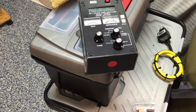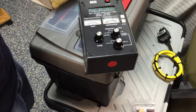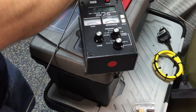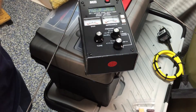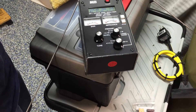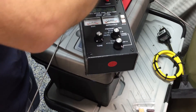This center radial is about to give up — I may end up having to replace it, which is fine. Hopefully it at least allows us to get tuned here. It's not going to allow us to get tuned — it's just too weak at this point. Oh good — well, it came free from the solder. That's bad because I didn't get a good solder joint, but it's good because I have an opportunity to fix this.